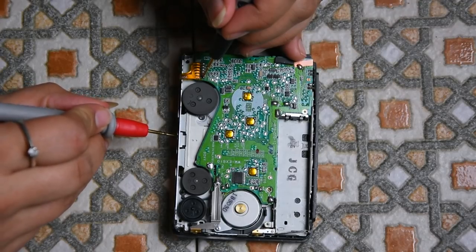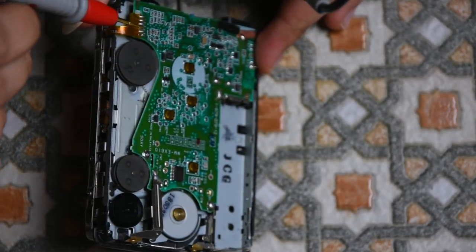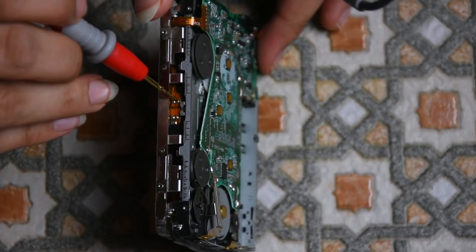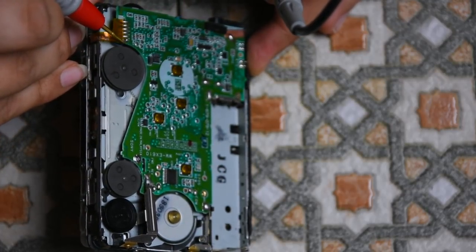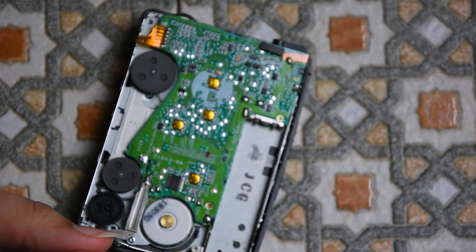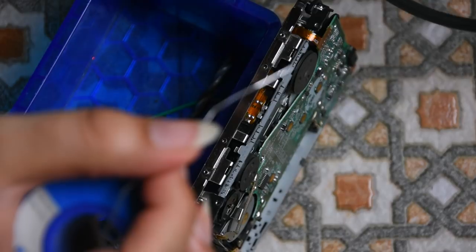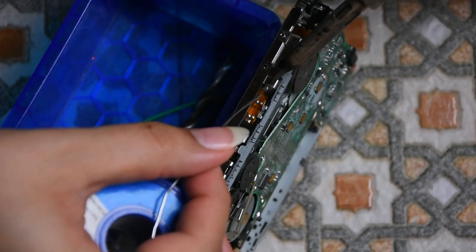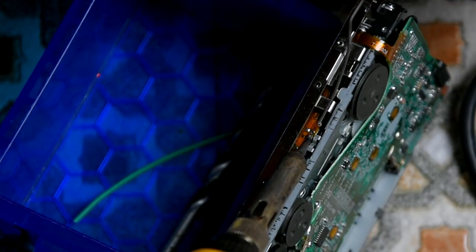This one is definitely cut — there's no connection to any of these. On the playhead, I've gone through each one and every combination. I think I've found it: this top one here and this first one do not connect. So what I'm going to do is solder a modding wire on each of these. This is going to be very tricky. I'm scared because I don't want to screw this up. Let's add some new solder to this very carefully.